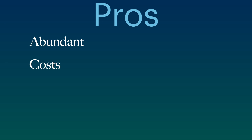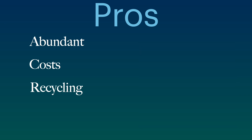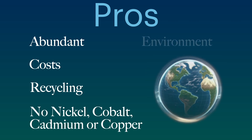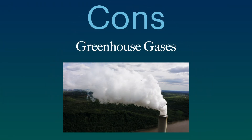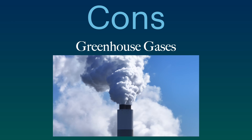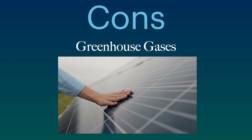There are some caveats to the next few points. Sodium-ion batteries may be easier to recycle, although because sodium is so plentiful, there may not be a financial incentive for companies to recycle — hopefully they'll do it for environmental reasons. The current generation of sodium-ion batteries doesn't use nickel, cobalt, cadmium, or copper, and studies currently show they are generally better for the environment. However, they do produce high greenhouse gas emissions during production due to the energy required, because the anode is often hard carbon which requires high heat to produce. Better technology and the use of green energy is expected to greatly reduce future greenhouse emissions.